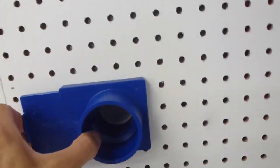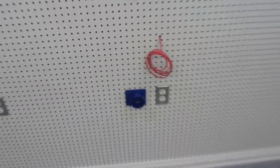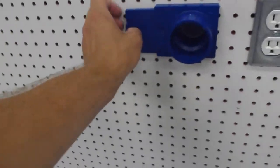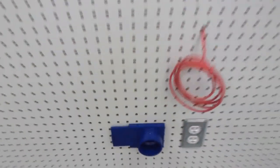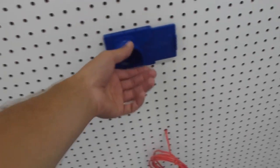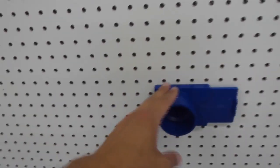As I've mentioned before, this is the main vac here at the bottom. This is where the shop vac is gonna sit, so this will pretty much be open all the time, and I'll have the vacuum hooked up to here. So that's gonna suck up from every other one of these ports out here. If I'm gonna be using, say, the chop saw here, I would open this one and it would suck up from this port here. And since all the other blast gates are gonna be closed, it'll just suck up from this one port here.